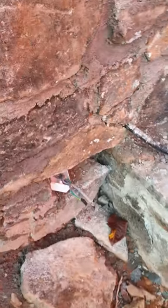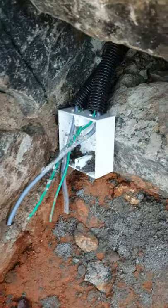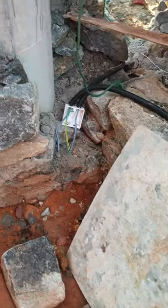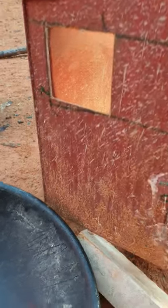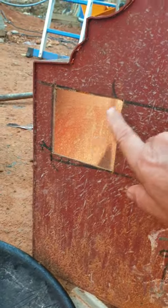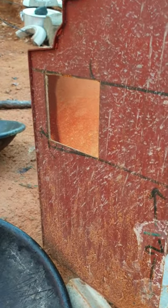In Sri Lanka many times you don't find any earth on the electric installations. I can feel that when I touch something and get some current, I don't like it. So here's another plug point and here's already a next one. Now why so many plug points? Because they will be very nicely hidden under the sitting surface on the sides. You see here, that's where the plug point is going to be. I just had that cut out to show the mason the level of the plug point, because it is a matter of centimeters. It shouldn't be too much in front, too much behind.